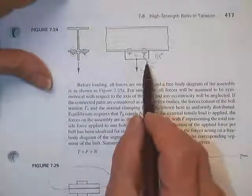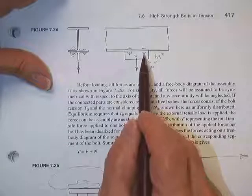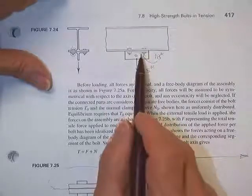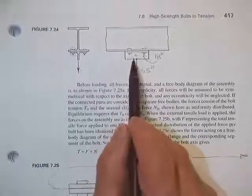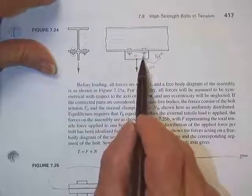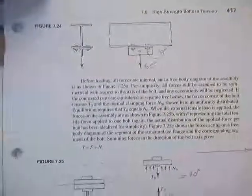When you put this force in the bolt — when you crank down the nut and stretch the bolt — you put tension in the bolt. That also means you put compression between the two surfaces. One thing that's good about that is if you also add some shear stress, that load will be taken by friction. Unless you don't tighten them enough, then they will slip and bear against the bolts — and that's okay. We can design for any of those conditions.